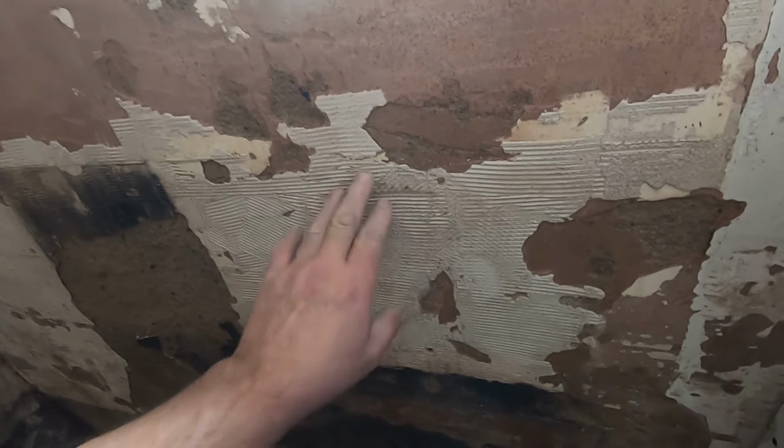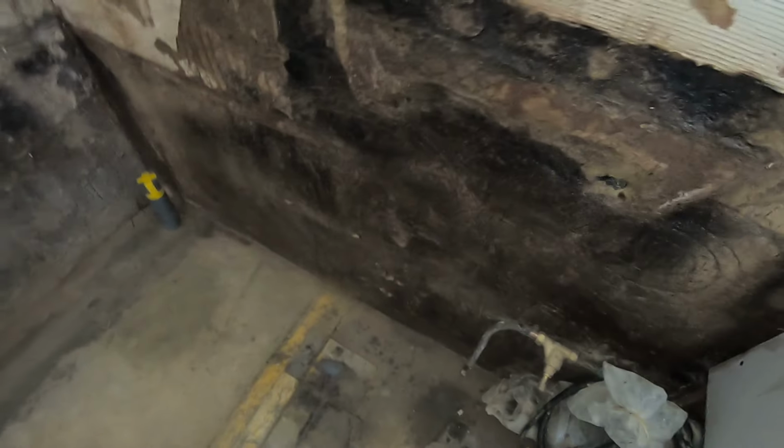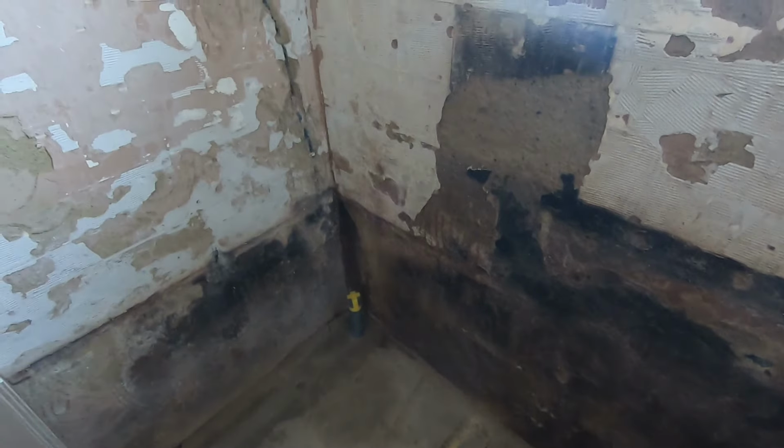last night after work, I came round and I gave this wall a really good coat of SBR. Now, some of this old adhesive here would not scrape off, so I've left it, it'll be fine. But some of this was sort of bare, I don't know, rendering, screed, whatever you might want to call it. But that's now, I don't know if you can tell, but that is completely encapsulated. So I gave that a really good coat last night. Far better than PVA if you use SBR, which I think is styrene, butadiene, rubber, or something like that.